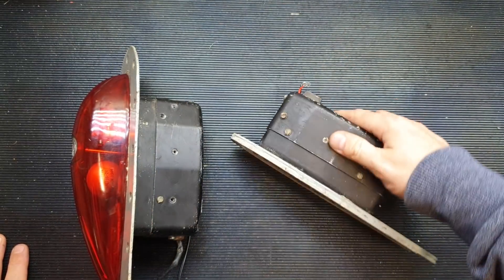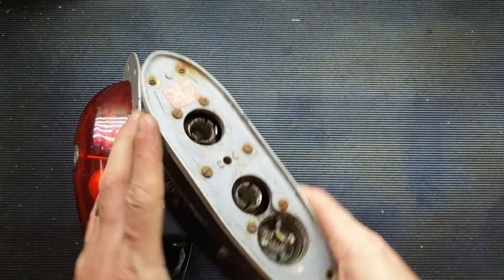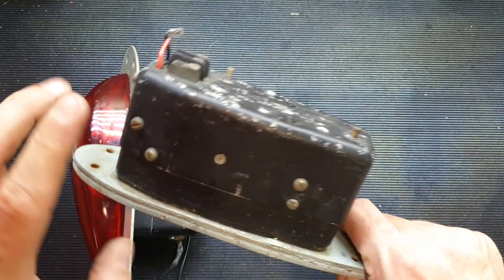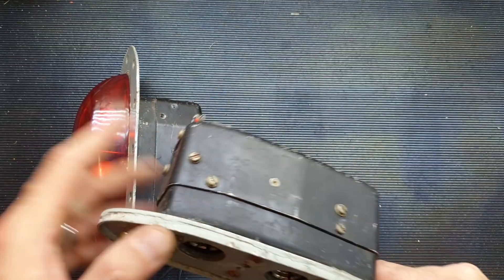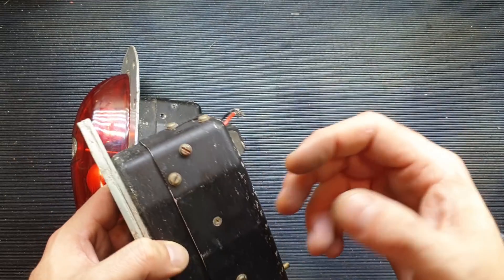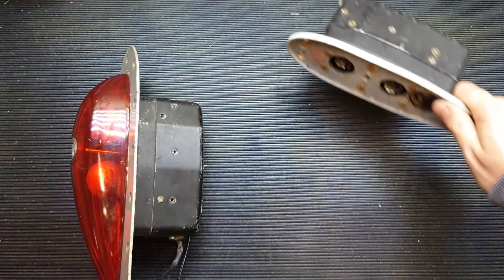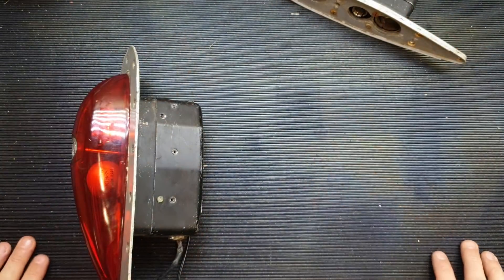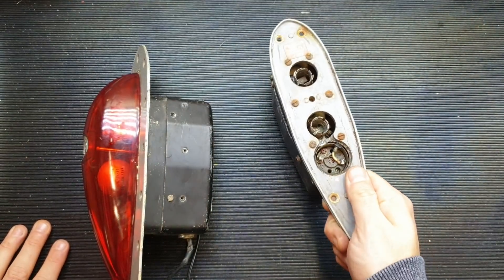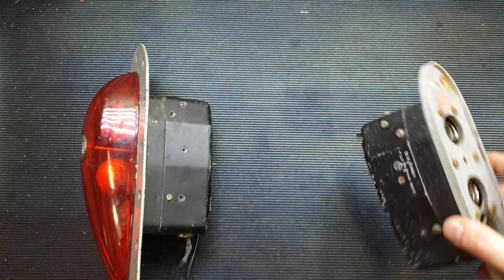This one incidentally is goosed. Notwithstanding the fact that the lens is broken - we do have spare lenses - this one is actually goosed. What's happened is the worm gear drive off the motor goes onto the main gear, the main gear has lost a couple of teeth, which caused the mechanism to lock up, the motor to overheat, and one of the contacts on the commutator to actually fall off, further locking up the motor. So yeah, disappointing that this one is absolutely goosed, but I'm reasonably content that we can reuse this plate on another unit if we can get hold of one.